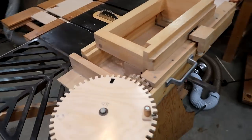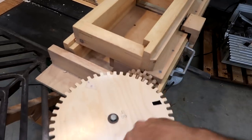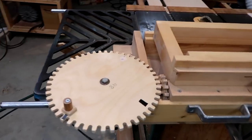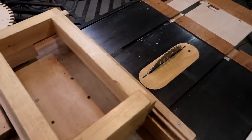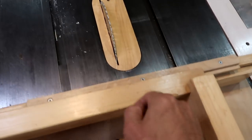Here's my very first screw advanced box joint jig. It actually runs quite nicely. It comes with just a 48-tooth gear. It's not presently set up to work with this table saw — the bar needs to be moved so that the slot lines up with the saw blade.